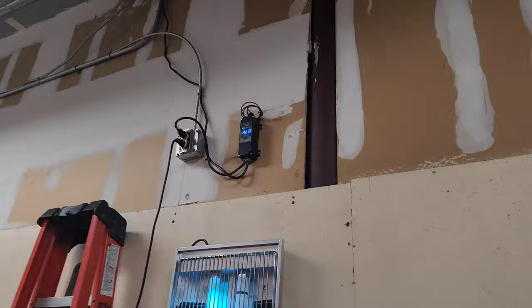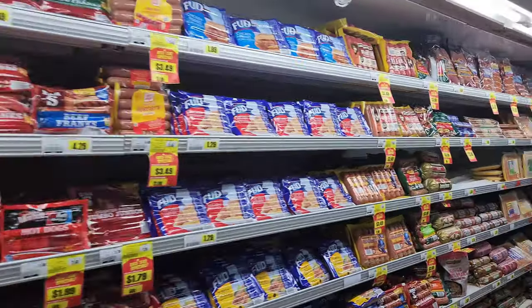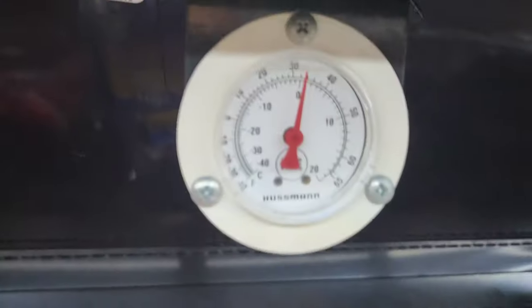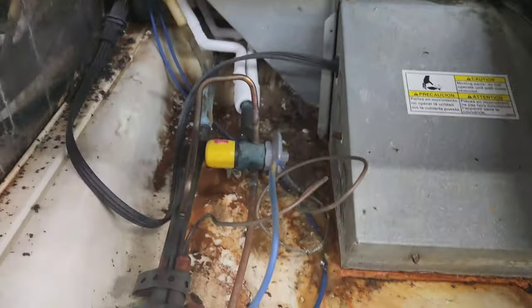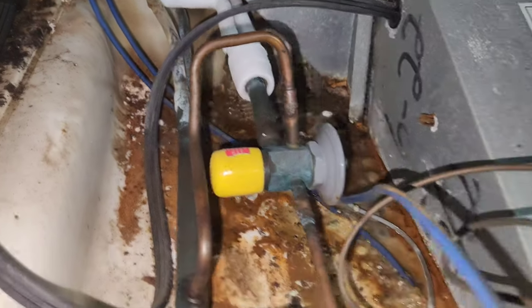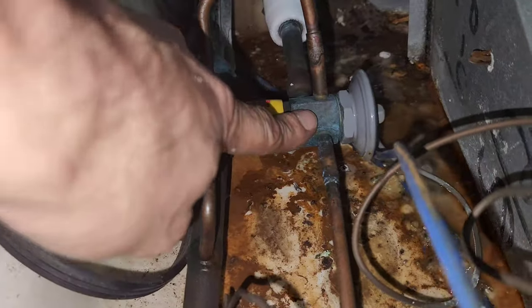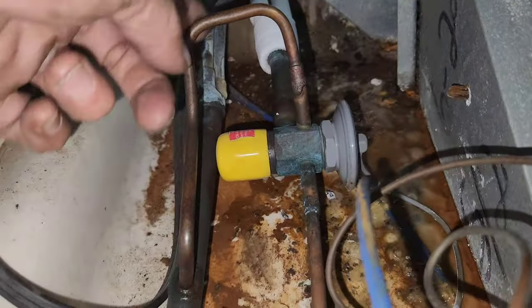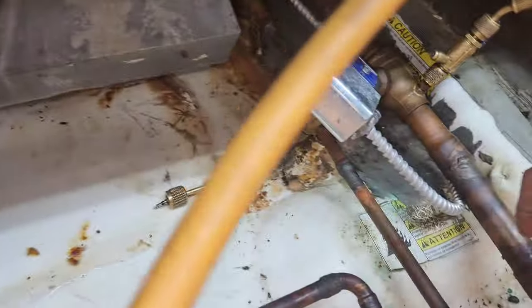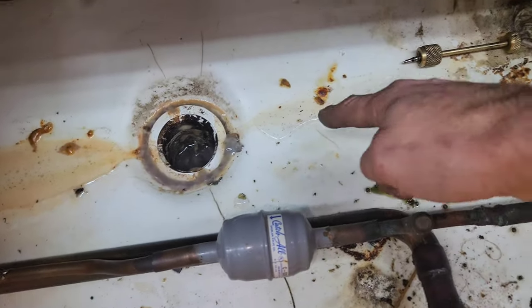It's a stupid place for a controller. Not much of a difference in frost pattern, but the body of the expansion valve isn't sweating anymore — this was sweating a little while ago. I'll put my Schrader back in. Look — we're condensating. We got condensation on the liquid line. How about that? That confirms we've got proper liquid feed now.